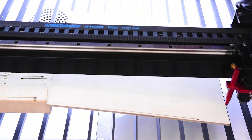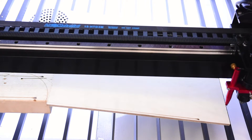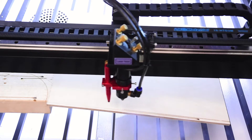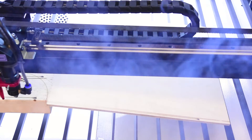I don't know what lens came with this at the moment, so I need to figure out my focus point. I've just done a quick little line here — I've got the piece of plywood up on a piece of 2x4, speed set to 200, and I'm going to hold pulse and manually drive this across, which is going to give us our focus ramp.